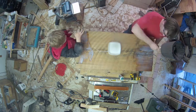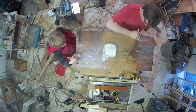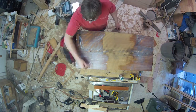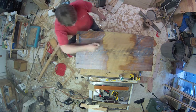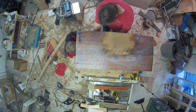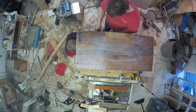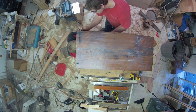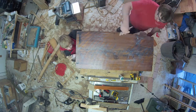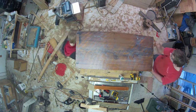Painting the edges? Yeah, we're painting it with a mixture of water-based poly and white Elmer's glue. It's about 50-50. I'm only doing that just to get rid of it because that's that Mod Podge stuff I'd mixed up for another project. But the white Elmer's glue mixed with that water poly does give me a nice hard finish. It soaks into the wood fibers and seems to strengthen them to some extent. I don't know how durable it is as a finish. It's proven to be quite durable in everything else. I've never seen anybody paint with a white glue water poly before, but it worked for me.